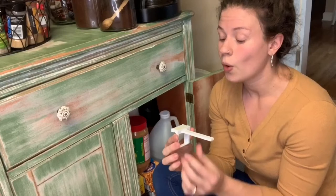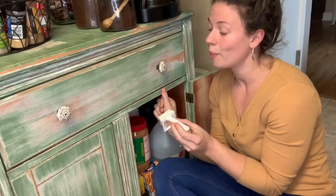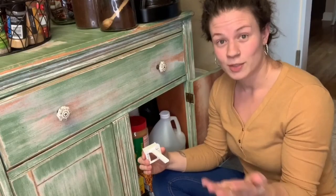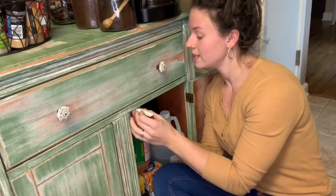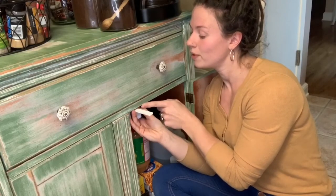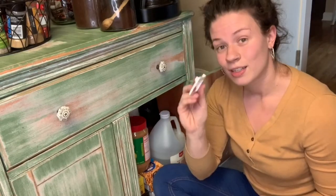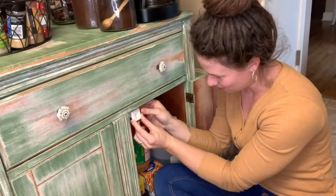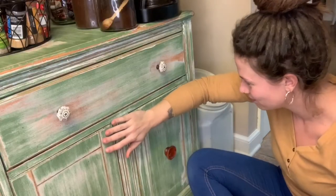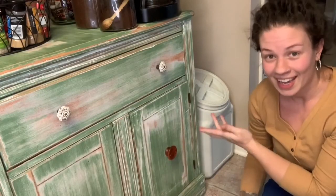What this setup allows you to do is hold the strike plate two centimeters into the cabinet — keeping an eye on the two centimeter mark on the ruler and lining it up with the front of the cabinet face frame. Use whatever the thickness of your door is as your depth measurement. Press and hold the strike plate into place at that depth. Then take the tools out, put your cradle back on the strike, put your locked lock into the cradle, close the cabinet door, unlock the lock, open the cabinet door, and press and hold the lock into place. And that's how to do an inset cabinet.